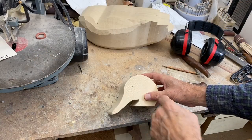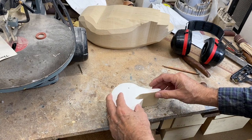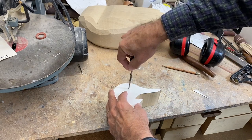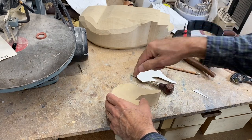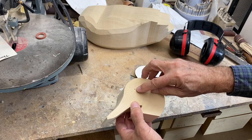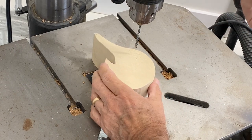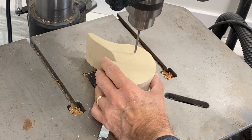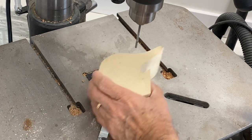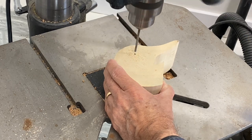We marked the eye location on this side. I like to flip the pattern over, get it lined up, and mark the location on the opposite side rather than drilling straight through. I prefer drilling halfway through from both sides so I know the location is precise. I use a one-eighth inch drill bit just as a reference hole — going in about halfway through from each side. They normally meet right in the middle, and that way I know I'm hitting exactly where the pattern says it should be.